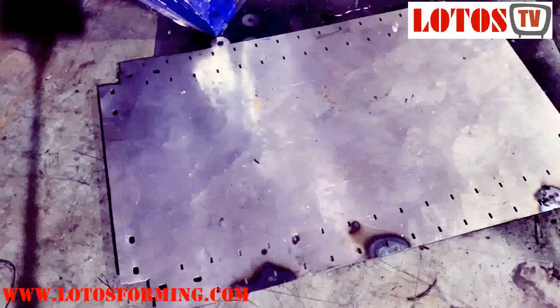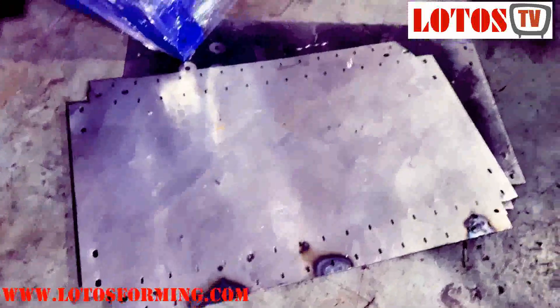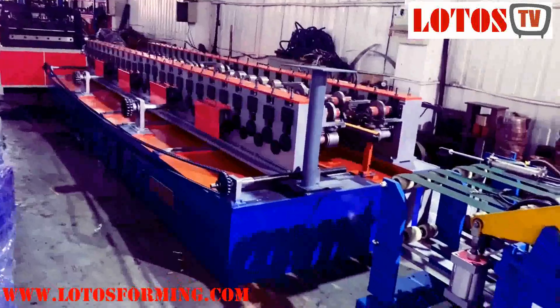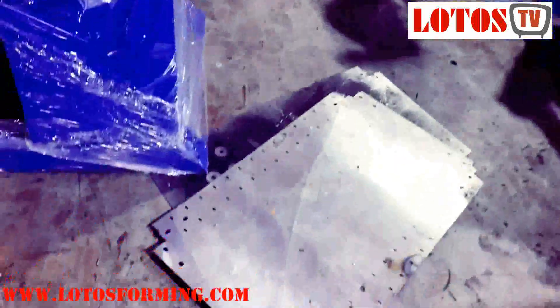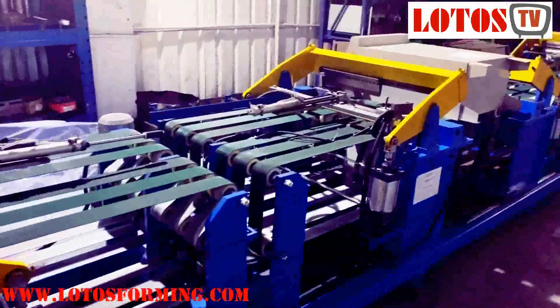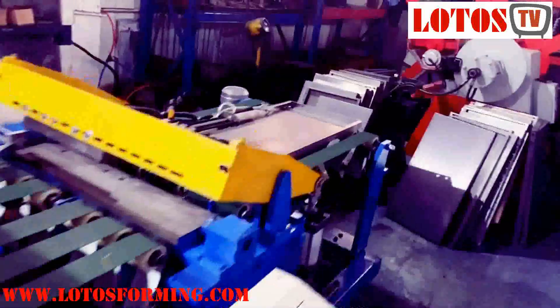This is not a qualified sheet, but we can see after it's cut to sheet — this is the product, this is the sized sheet — which will be fed into the forming machine. Of course this is not a qualified product, that's why it's disposed here. Under flat shearing it will be cut to this kind of sheet, then fed into the forming machine. After forming, we will come to this overturning and folding device. In the last step, we will have this finished product.